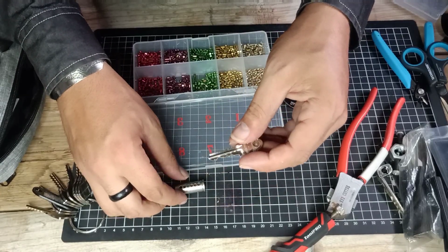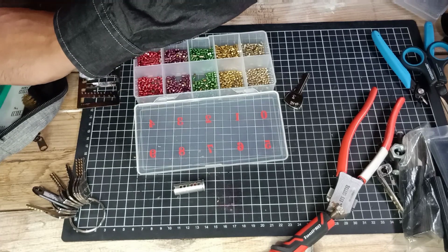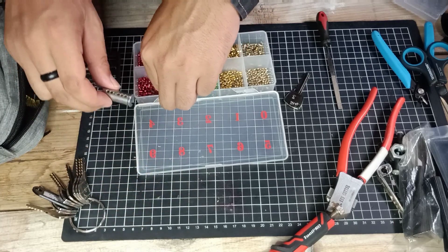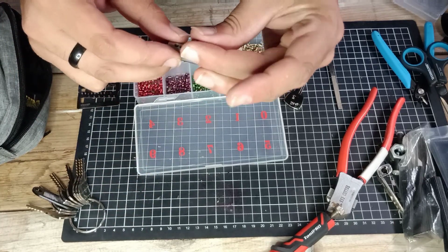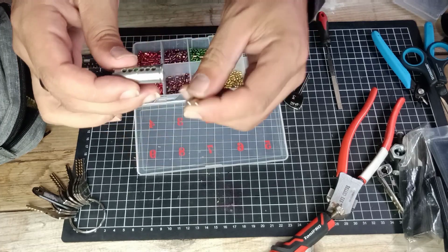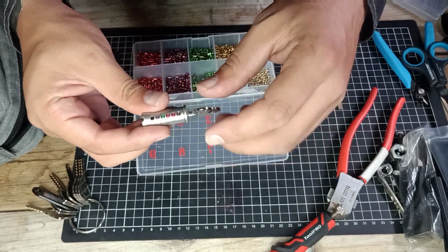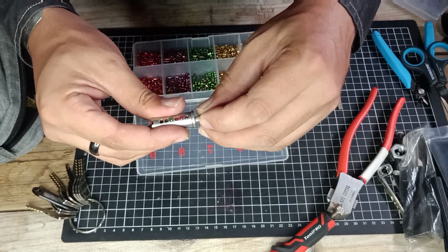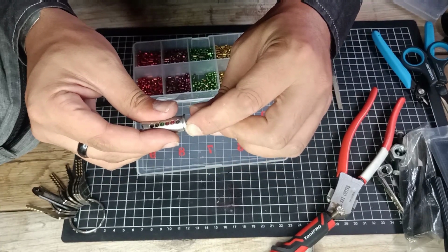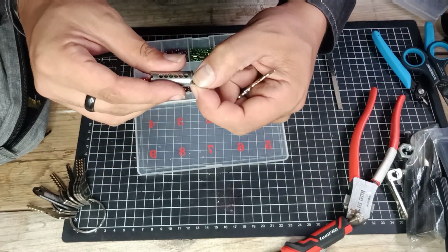So that might mean that my slant is actually off. So what I can do is that is a 3 cut. It should be a 3 cut now. Just double check. Put a 3 in the back there. Yep, that's a beautiful 3 cut. Look at that. Flush. But the key is quite catchy to come out. It should be nice and smooth, which should tell me that more than likely the slant on the last cut isn't right.